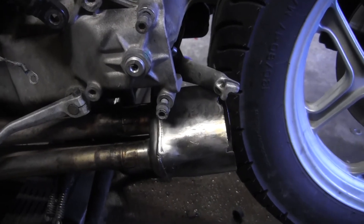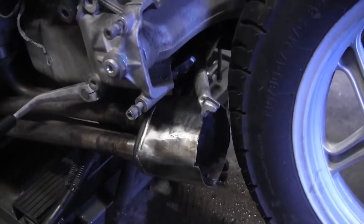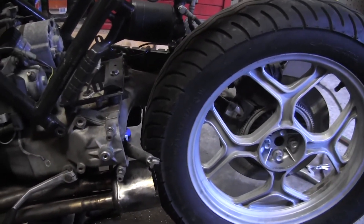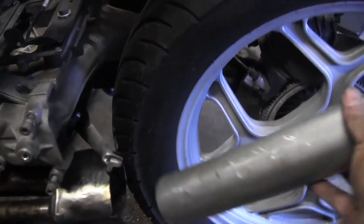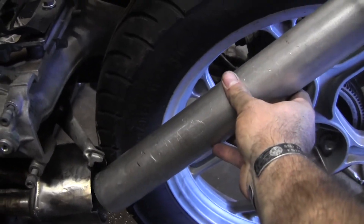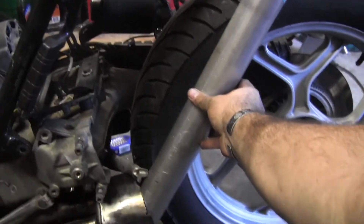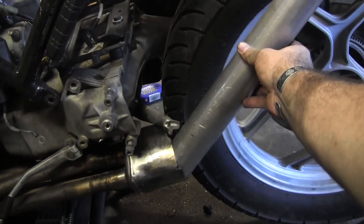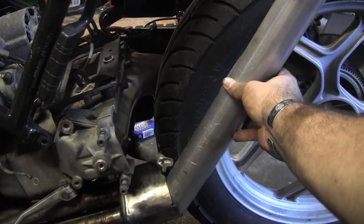After a lot of beating I finally gave in and heated, stretched, welded, and squeezed — and that's kind of what we come up with. You can see the original pipes in there. You can see how it comes up off the bike. Eventually it's kind of what it's going to be like — kick it up more with the angle of the frame, bring that out, and you won't really see the rest of the inside. We'll get a muffler and call that golden.